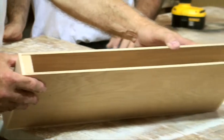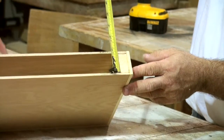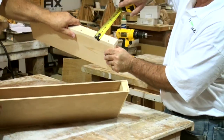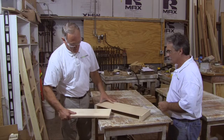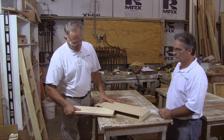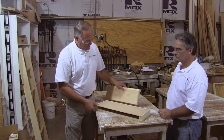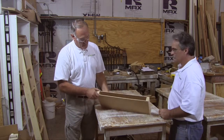Next, we're going to show you how we built our hidden shelf. To make the shelf, we ripped a piece of one-by-four spruce one-eighth inch wider than the one-by-two we used on the bracket. The reason why we are ripping the lumber is that dressed one-by-two actually measures inch and a half, so this piece should be ripped inch and five-eighths. Be careful in ripping — you may need some help, and a lot of times a local lumber yard or cabinet shop in the area will rip that for you.